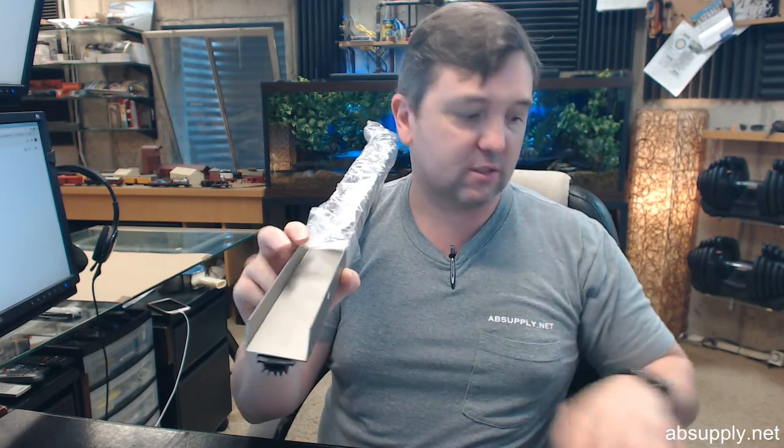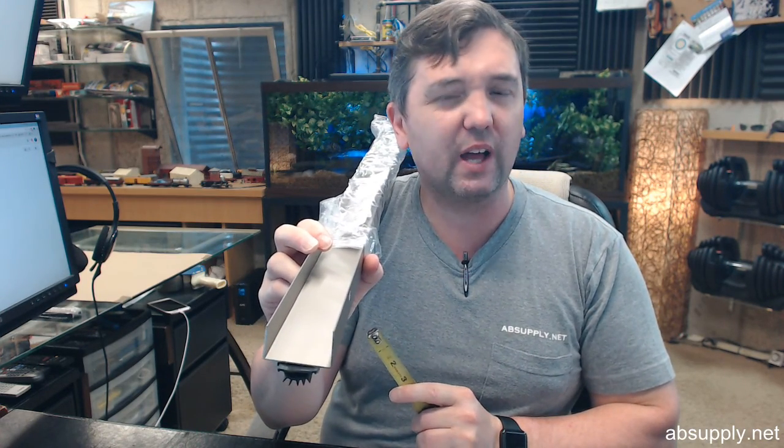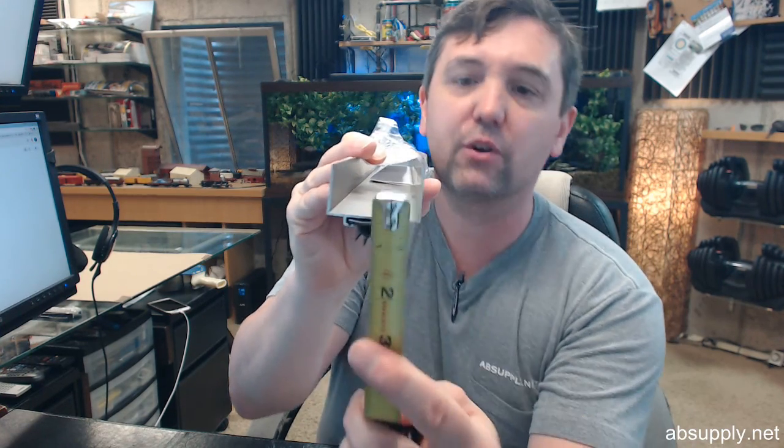Then, of course, the core of the door: as you drill through — let's say this is a metal clad residential door — you expose the actual steel itself, allowing corrosion to attack that inside wall. I would put the screws on the inside for that reason. Aesthetically as well, I would prefer the exterior of the home to look neater than the interior.